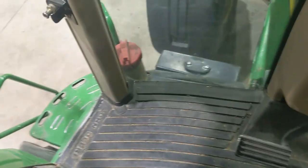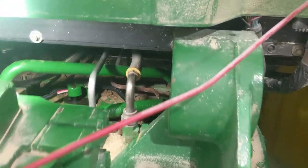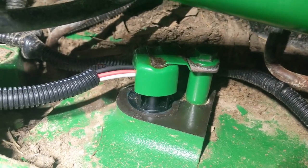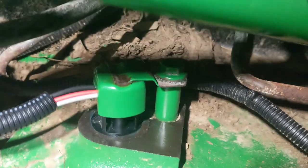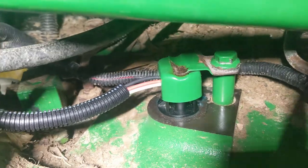So what we've been digging into here — let me show you guys where the sensor is at on the tractor. You've got to go to the back of the machine by the draw bar. If you shine a light in here, the ground speed sensor — let me zoom in so you guys can see. This tractor doesn't have a three-point, but if you had a three-point this would be a more difficult job. It sits right on top of the differential housing here, and you can see there's three wires coming out of it: red, black, and gray, with a spacer and a hold-down on it.